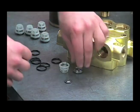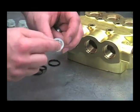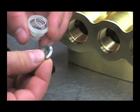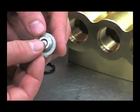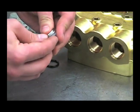We'll put the valves back into the head. We'll want to reassemble these with the spring in the cage first, and then we want to face this poppet in this way, and then snap the seat back into the cage.